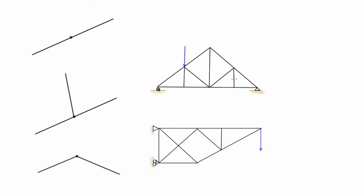Let's go through these two examples and pick out all of the zero force members we can find. We already mentioned this one — we have two collinear members with a third member that's not in the same line as them. Obviously if this had any tension or compression in it, it would make this joint out of equilibrium, so this is a zero force member. Knowing that this one is a zero force member — if it's zero force it might as well not be there — here we have another two collinear members with a third member that's not in the same line, so by this definition this member also has to be a zero force member.